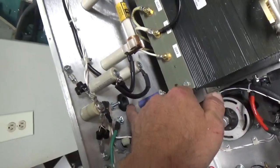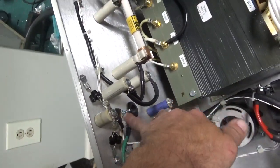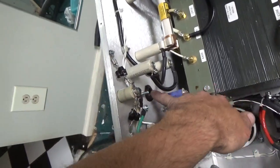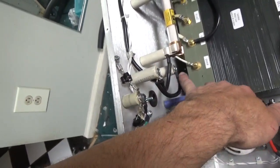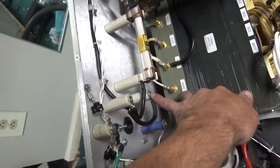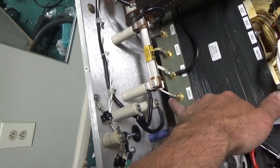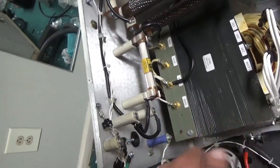And that braided material will have a ring terminal which will be at ground potential. So the customer will take the cover off, run it through here, connect the ground, and then the center conductor will have a ring terminal that will connect underneath this screw right here. And that will have an internal tooth crush washer — slash lock washer — underneath it.